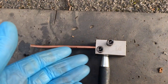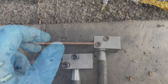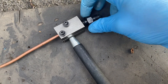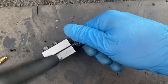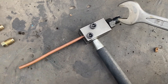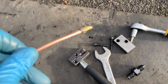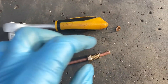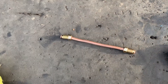If you're doing this with a closed end you always need to put the fittings on first, but obviously with this one I can put that on in a minute. Tighten that up, and then I need to screw that end into there. This is going to require two hands. I'm going to hold that with one hand and turn this with a spanner using the other. Once we've completed that task it leaves us with an olive on the end. Then I put a nut on it, and another fitting on it, and put an olive on that end the same as I just did, and as if by magic I've now got a link pipe that should screw into the fittings at each end.